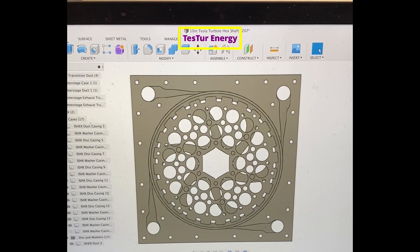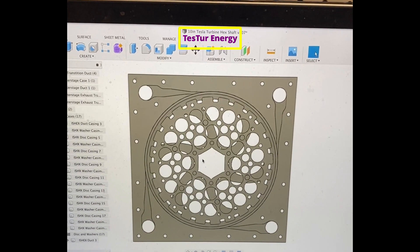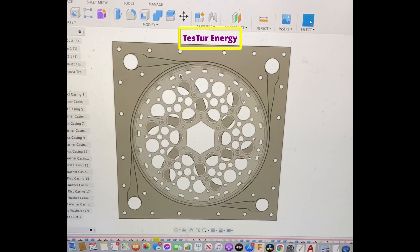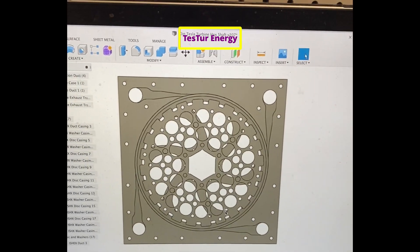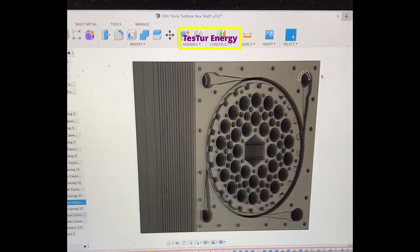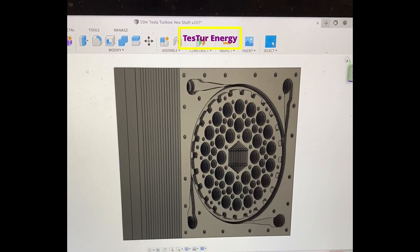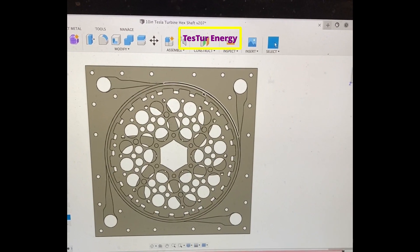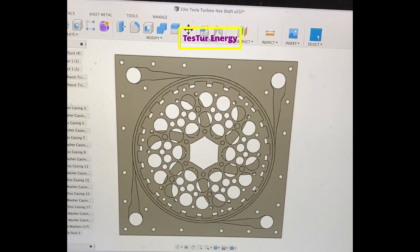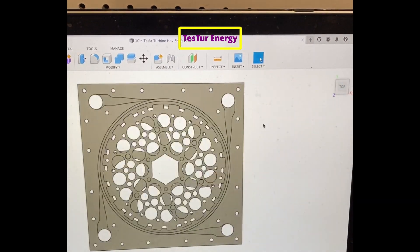Still a work in progress, but if this is at high enough pressure, this whole stack in here should flow like a hydrodynamic bearing and I can get a little bit of thrust from it. I also noticed that these look exactly like the cavitation heater design I had, so we might actually get some cavitation happening in here from the heat exchange and the pressure — I'm not sure if it's going fast enough, but it's possible.